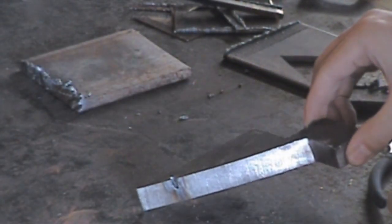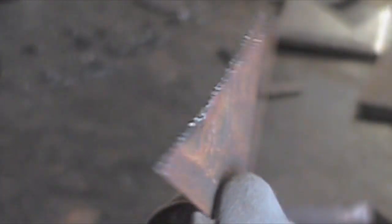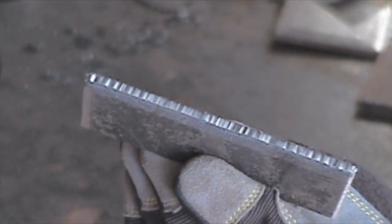That's the piece of 3/8ths plate that was under the clamp. I think if you hit that with an angle grinder — a sanding disc or something — you're going to have pretty reasonable results. That's the 3/4 inch; you can see we didn't even get halfway through that. And this is the 18 gauge again — there wasn't really any slag on there to begin with, so that's kind of a waste of time.